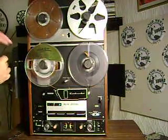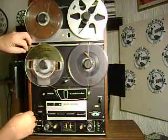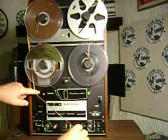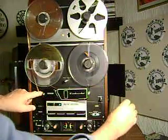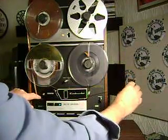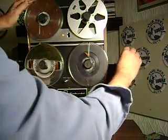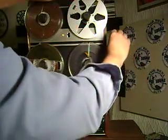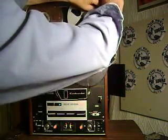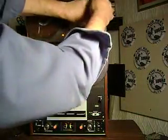Now you take your blank recording tape, and it first goes through, see how it's going into this reel, and it's using that as a tape guide too, and it's coming down, and now you're loading it like you loaded your tape before, from post to post. Make sure there's no curves, nice and tight, comes up into this reel, uses this reel as a tape guide too, and then you're coming up to your take-up reel up above for this tape to do it.